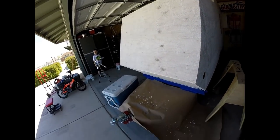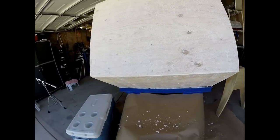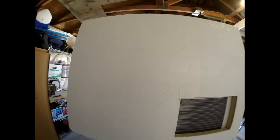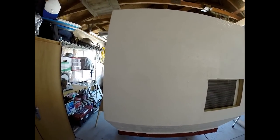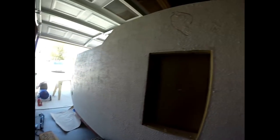All I've done is started to add some thinner to it when it thickens up, so I get my money out of it — I don't like throwing away the big globs, and this stuff's not cheap. We're coming along, I'll update you here in a bit. Working my way around, I've got the final fourth coat on the back — it's still pretty wet. Some of the third coat areas you can still see a little bit of wood grain, but I'm thinking this fourth one is gonna do it. The beauty of this is six months from now I can just come right back and coat over it again.